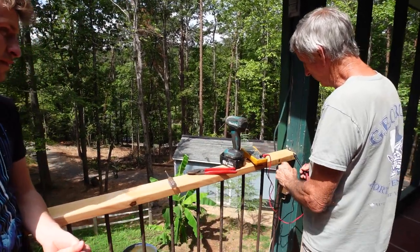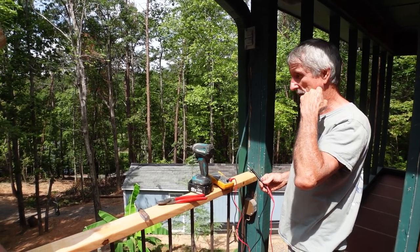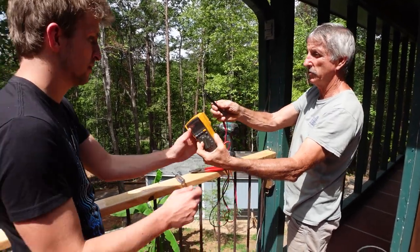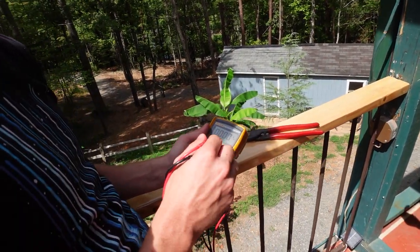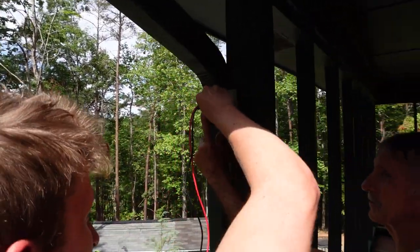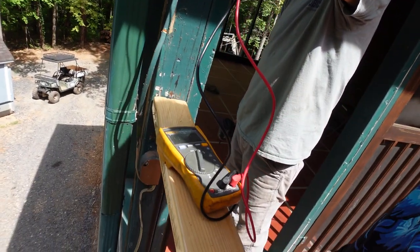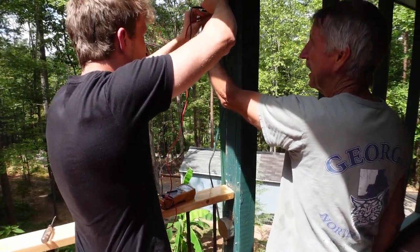What we want to do is remove this outlet, but we don't want to go sticking screwdrivers in here without knowing it's dead. So we just test it first. Put the meter on the alternating current voltage setting and stick the probes in there. Move it around and make sure you get good contact everywhere. Nothing — so we know there's no voltage there.